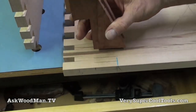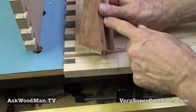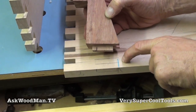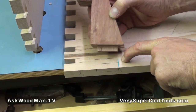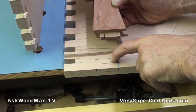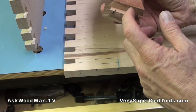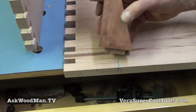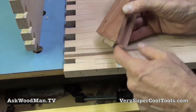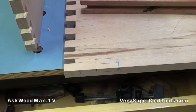I'll make a little correction right here. So this piece is going to fit like this, but I don't want where this comes down here and makes that slot for the drawer bottom — I don't want this tenon to be that close. I want there to be a little bit of a gap in between. So I think I'm going to shorten this back another 7/16s or something like that. I'll just address this here and re-mark it. I want there to be a solid gap so this just doesn't spill over and be part of that tenon down there.